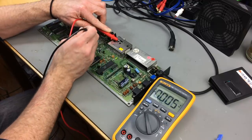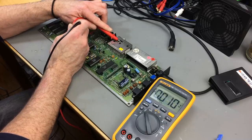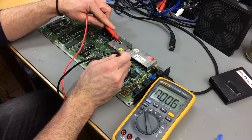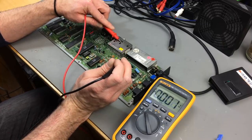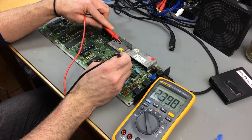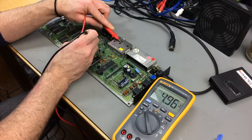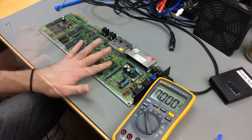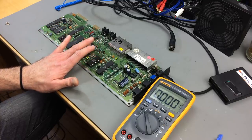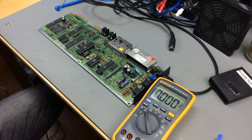The 5 volts seem to be a bit low, actually. Maybe something's shorted somewhere. So that's a bit low, really. It should be a little bit like 5.1 volts or so, usually. That's a really tiny bit low, the supply voltage. So I suspect there's something going on there, with maybe a short or something. So the ICs get warm, actually. So I think I'm going to have a look at the voltages with the scope, I guess.